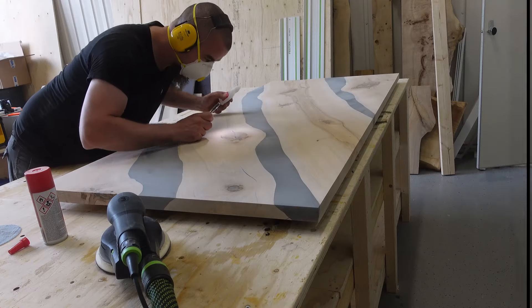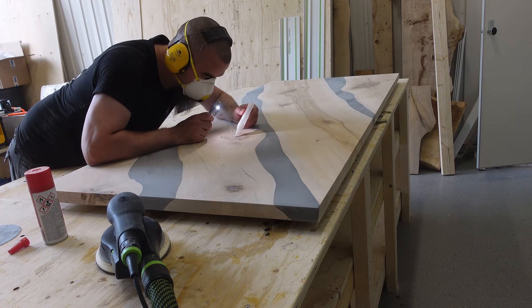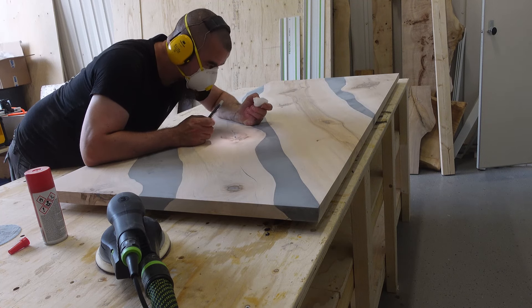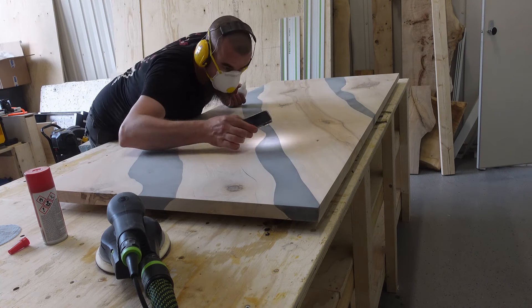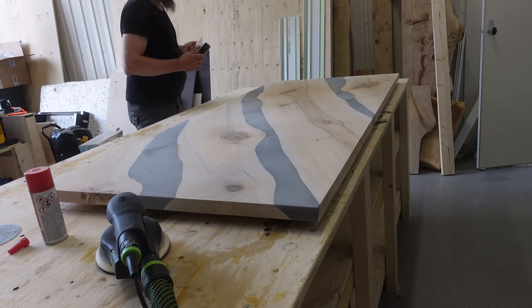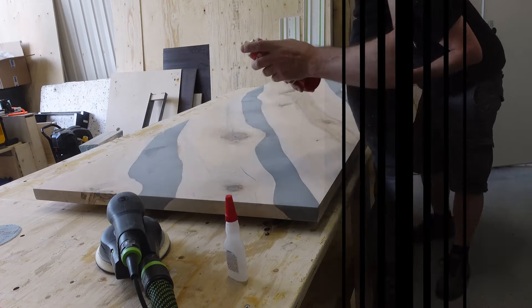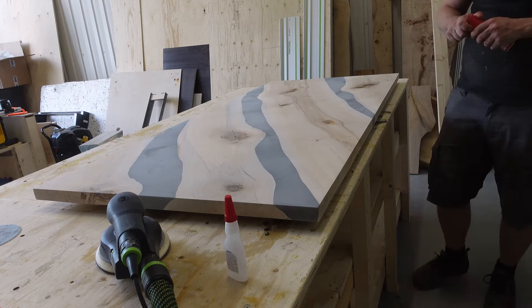As you can see, I don't have any professional lighting, so I'm just using my mobile phone to see all the tiny holes I might have, and using CA glue and activator to get rid of them before starting to sand. The router bit and the setup I used left much less problems to be fixed, so as mentioned I'm very happy with it — usually this phase has taken hours, and now I think I was able to do this part in maybe half the time.